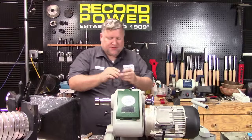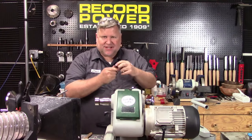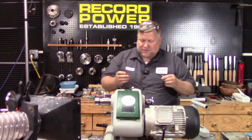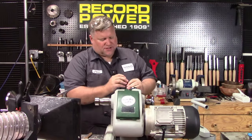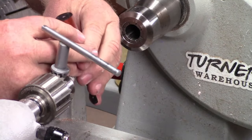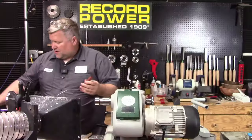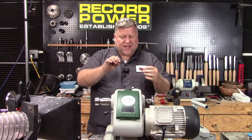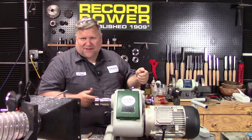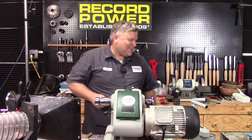You can see the tip of the refill probably one or two millimeters inside — which is actually quite good. It feels snug without being super tight or super loose. Now we're ready to put the tenon on this, so I'm going to put it back in the chuck and mark out the tenon. I estimated 8mm for the tenon. It would be nice to throw this in the cleaner — we can do that at the end.